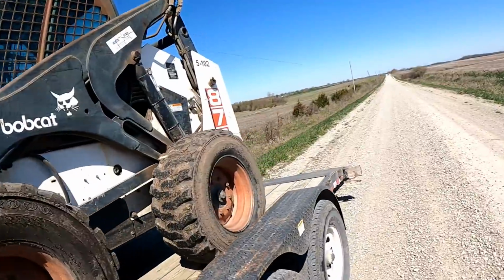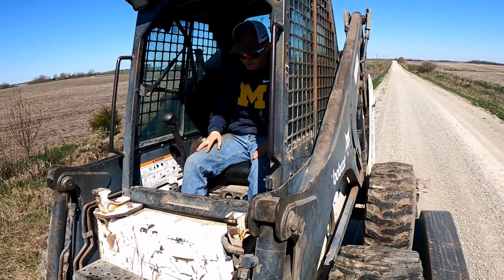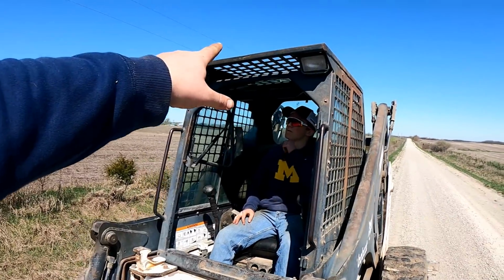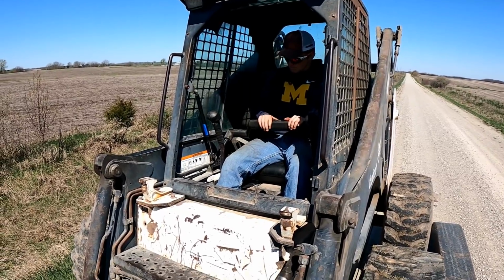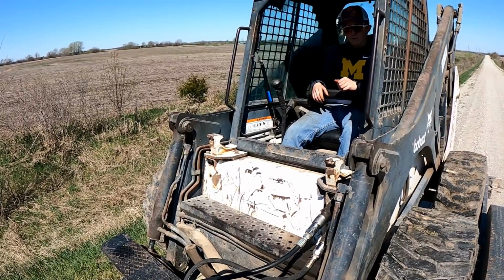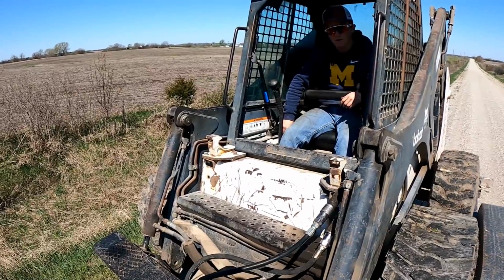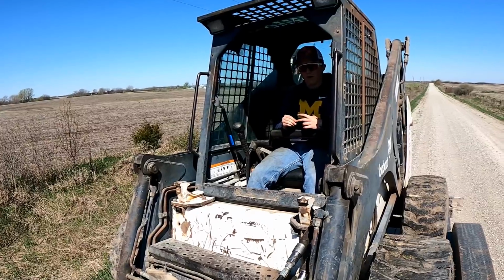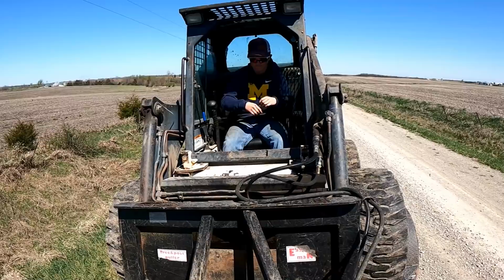Turn the key. Foot and hand controls. So the foots run your arms. To the right there's your lap belt. Pull it down onto you. Okay, now hit the foot pedal. Oh, that's your bucket. Some throttle. Yep, throw it forward. All right, a little more. When you're operating this thing, full throttle the entire time. There you go. Now your other one's your tilt. There you go.